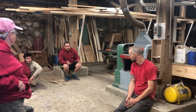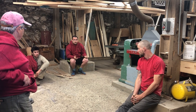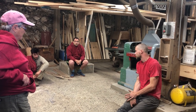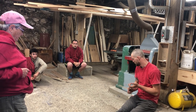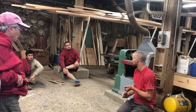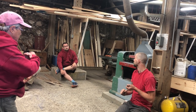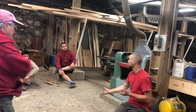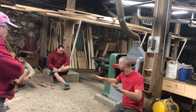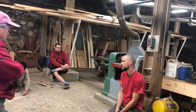If you're sanding and you start seeing the bung heads displaced — paint is thin over the bungs but normal on surrounding wood — it's telling you electrolysis is happening. If you have zincs and they're corroding rapidly, you can surmise you're pulling a lot of zinc into the fasteners. If there are no zincs and there's a combination of metals, one metal is pulling from the other and you're getting corrosion on a fastener. You need to take in all the information and go from there — it's not one size fits all.